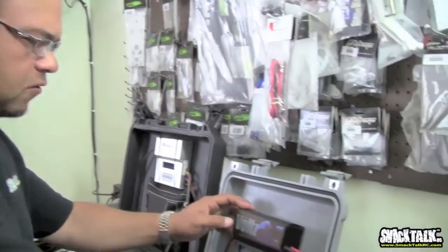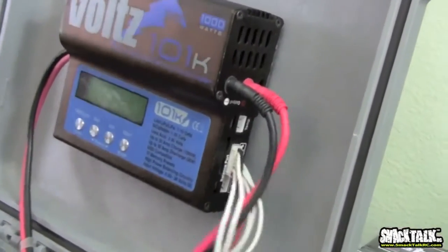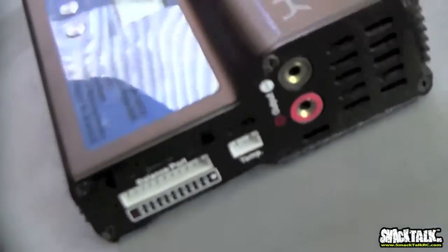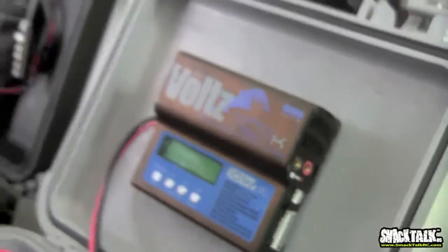And then the balancing while charging. Always try to balance while you charge. And like I said before, you look for high-powered balancing circuitry on your charger. At the same time, you want to make sure that you have balancing circuitry to begin with. On this charger, for example, you balance through this port on the side, and you can buy boards that plug into that and convert from JST type balancing to TP type balancing connectors and so forth. Even without taking into consideration the balancing circuitry power, take into account that you have to balance every time you charge. Just don't ever charge without balancing.